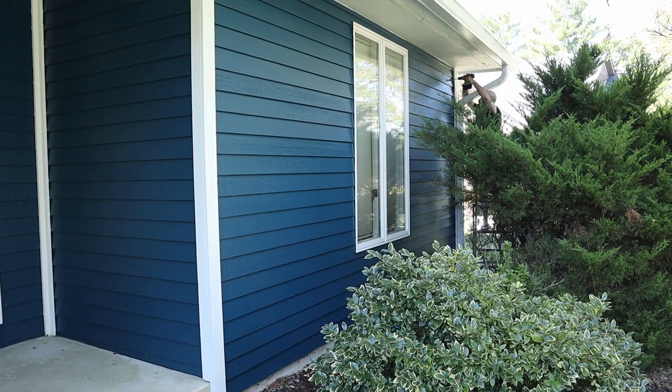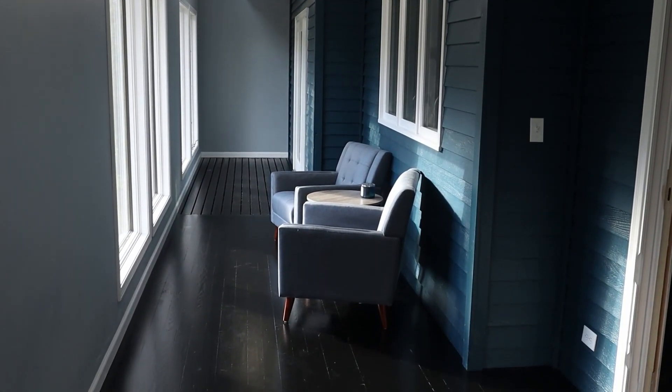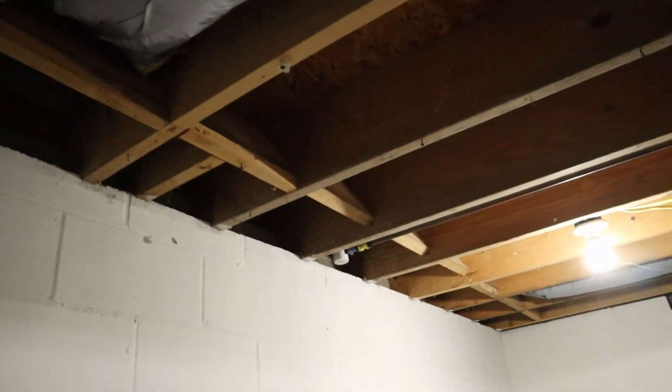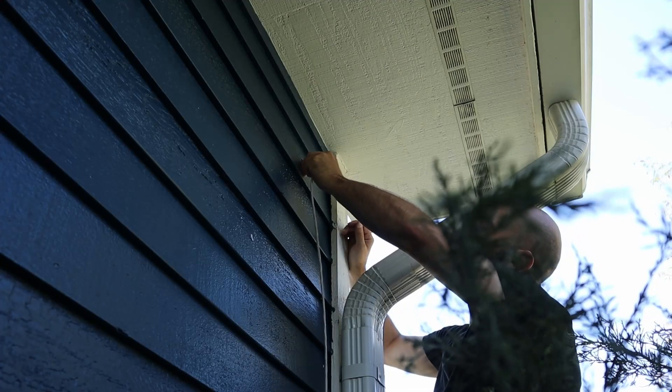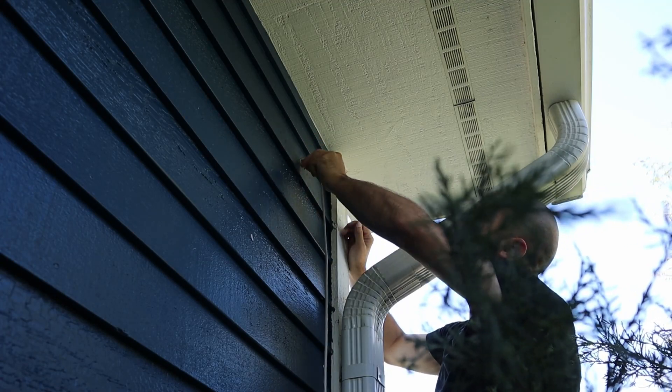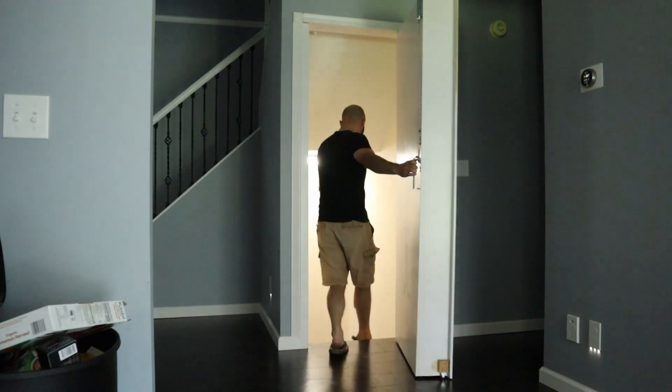Then I started picking out places on the outside of the house where I wanted to mount the cameras. The first camera I installed sweeps across the entire front side of my house. My house has a solar envelope on it, which means there's a solarium on the back side, and the entire front side is a double insulated wall with an air gap between. This air gap came in really handy — I could drill through the siding into the wall cavity, then run my ethernet cable through the first wall into the gap and drop it down into the basement where the NVR would be placed.